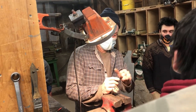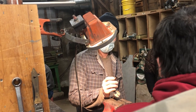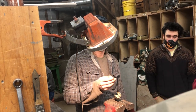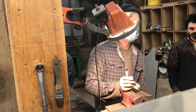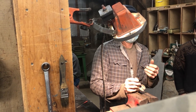Right, of course. As soon as you file that inside face, now you've gone from making a 3/4 inch bung to a bung that's a 1/64 larger or a 1/16 larger. So it can become this kind of compounding error if you're continuing to file those inside faces. You don't touch the inside because you're changing the size of the bung.